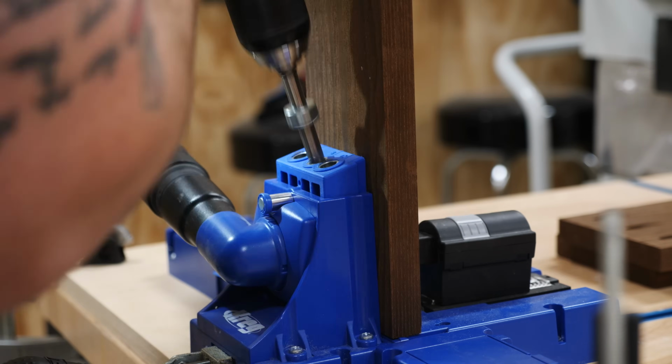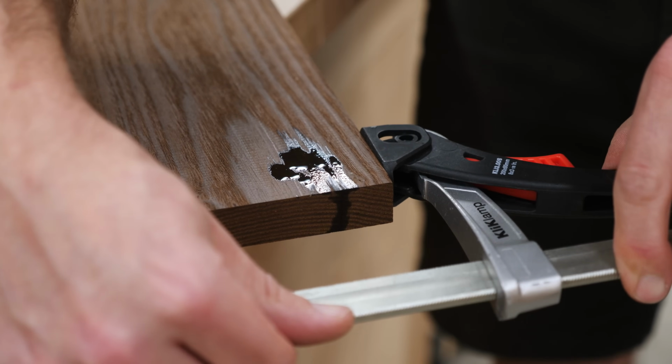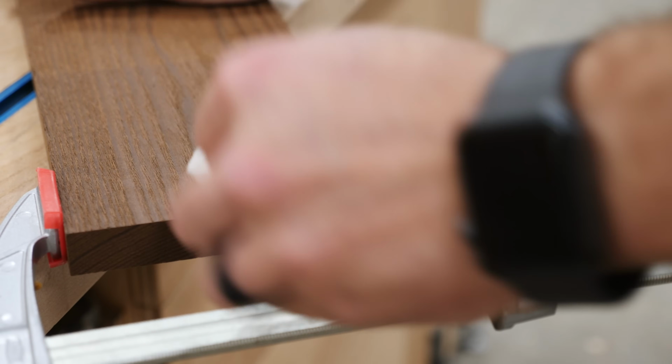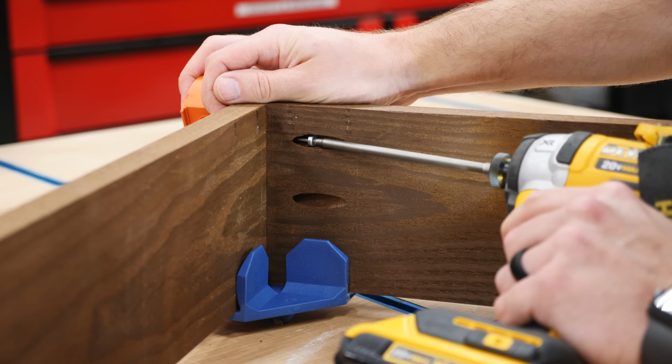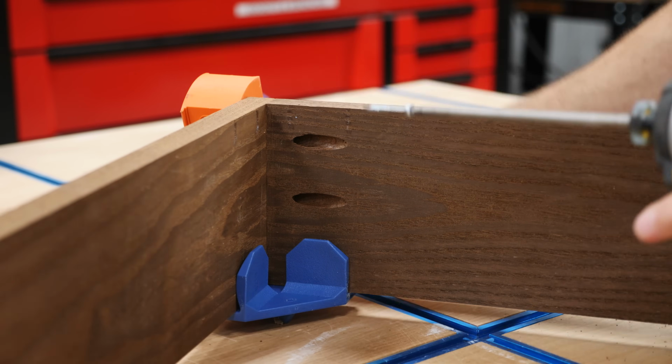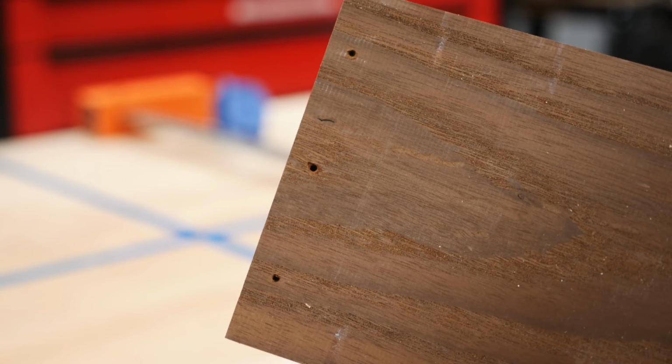And I think something like dowel joinery or dominoes would have worked a lot better on these joints. So to fix the splitting, I added some thin CA glue to the cracks, clamped them together, and then added some activator. To help prevent further cracking, I would clamp the joints together, drive the screws in slightly to mark the hole, and then take the joint apart and pre-drill the holes.